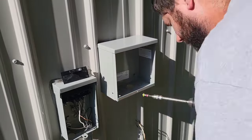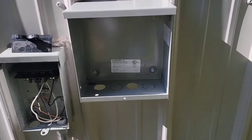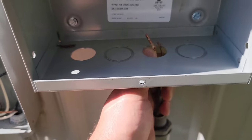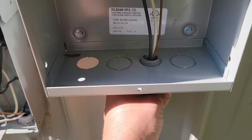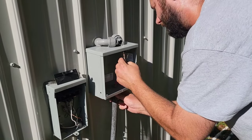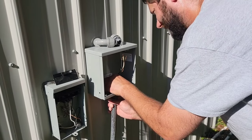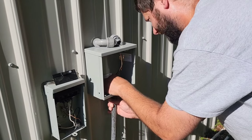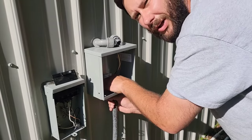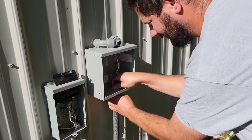I'm going to put the last two screws in, and then we're going to work on the wiring. The box is mounted. Now I'm going to bring this conduit into the right side of my box, making sure we get enough slack — we don't want our wires crossing. Once we attach the conduit fitting into the knockout, get a one-hole or two-hole clamp and clamp that conduit below the box to the wall so it's secured.